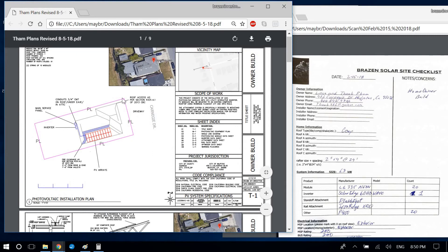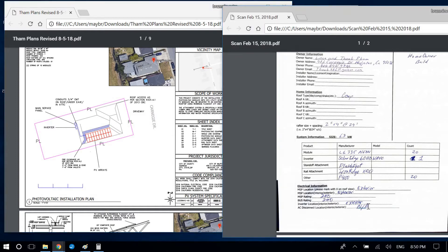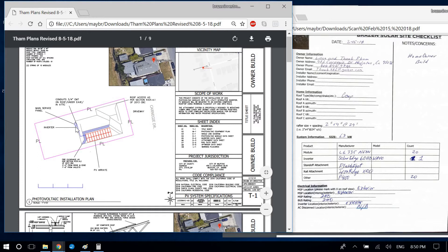You drew the proper re-wire very well. You have the inverter and main service panel shown. I would add an AC disconnect if required — it wasn't required on this project, so you're good not to include it, but that's where I would place it.